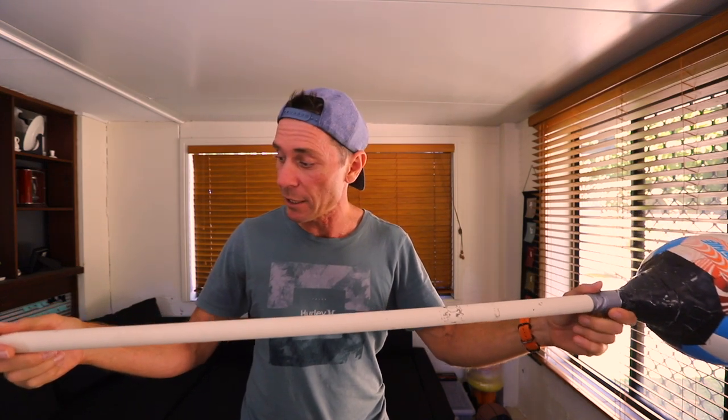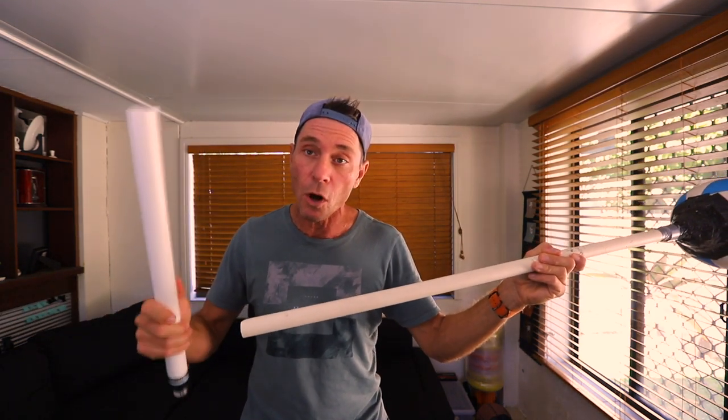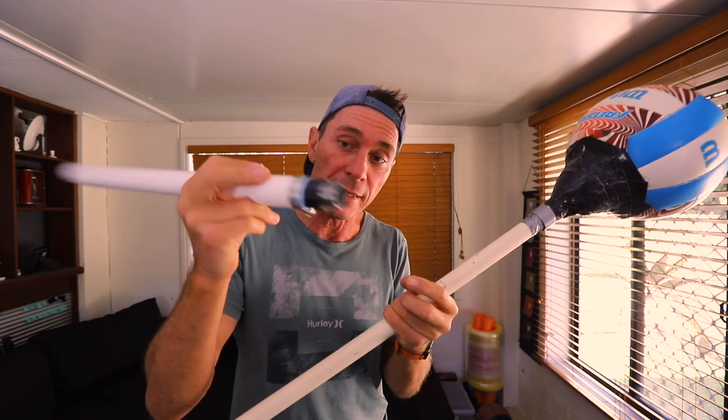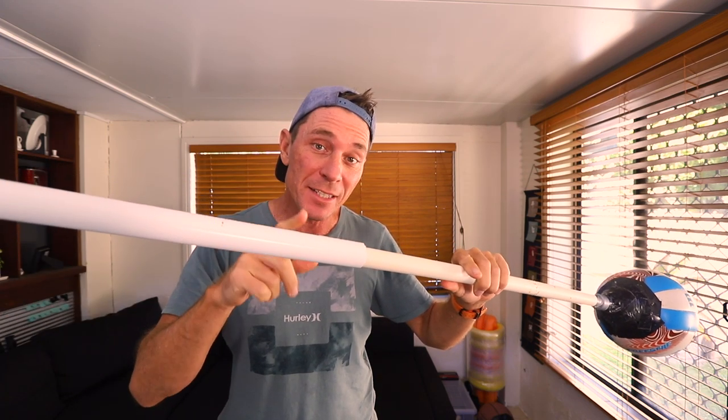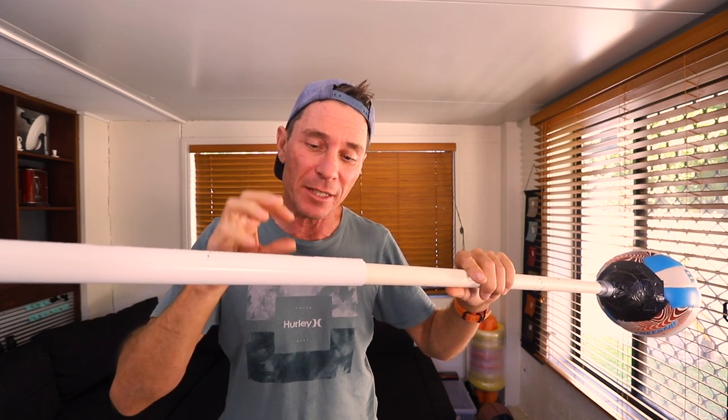Going further down the one-inch PVC pipe, I've kept the top section at approximately half my height — I'm six foot, so this is a three-foot section of pipe. This section goes into a lower section of pipe, which in turn mounts on a galvanized steel pipe using a hose clamp, allowing height adjustment. The reason this is a stronger design is because of the overlap of two PVC pipes at the point where it previously broke and flexed — using two pipes increases the strength.